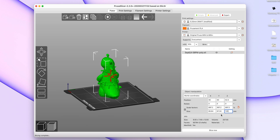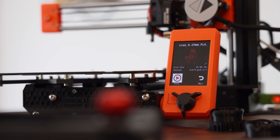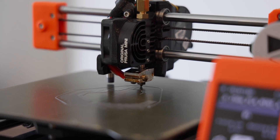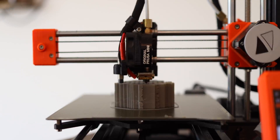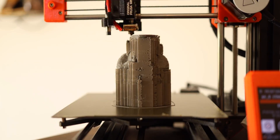Now that I have the model cleaned up, I can scale it to a size close to the original — I made it about four or five inches tall. I ended up printing this on the Prusa Mini with a 0.25 millimeter layer height and 10% infill in gray PLA. I went with these settings because I didn't need the model to be super strong — it's just going to sit on a table — but I did want it to print as fast as possible.